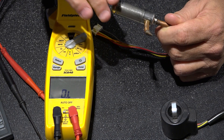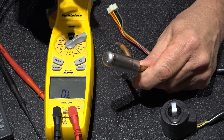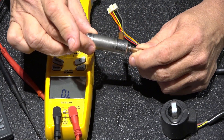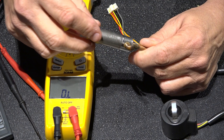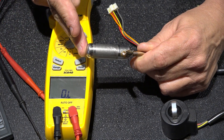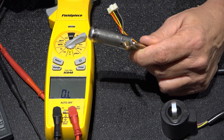There are two main components that make up an EEV valve. One is the valve body assembly. Normally there's a stainless steel casing on here. There are times that you do have to clean this up and polish it back up because it'll get some light corrosion - referred to as white rust - where the stainless steel oxidizes from a lot of moisture and the coldness of the water.